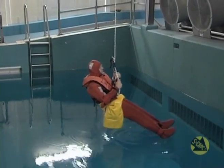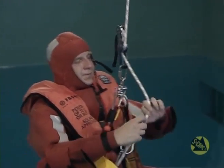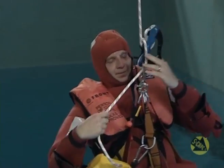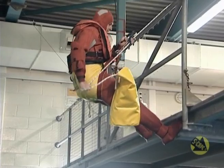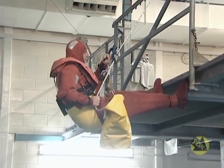To stop descending at any point, let go of the black control handle while holding the unweighted rope. Lock off the device. Remember, the handle alone is not the brake. Braking is done with the brake hand on the free end of the rope, so make sure you continue to hold the unweighted rope throughout.